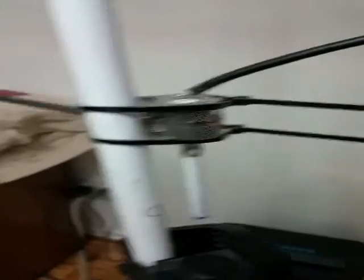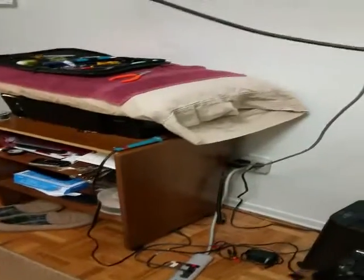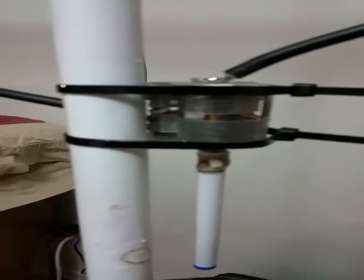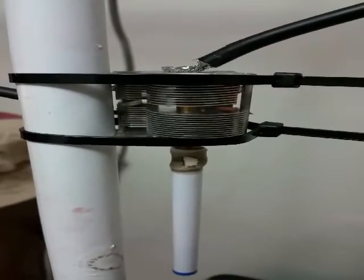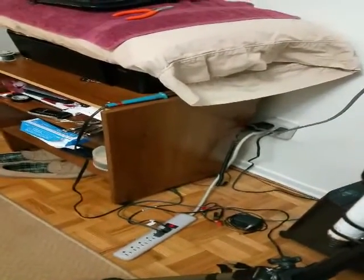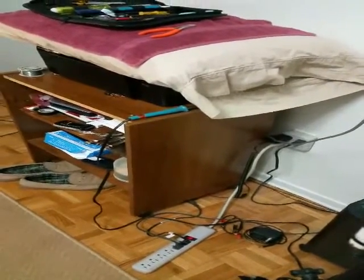The sweet spot on this is so small that you can't really hear it with your ear. You can, however, see it with the SWR meter. The main problem with this is the plates are really close together, so if I go above 10 watts it arcs over. I'll be back in a minute with the actual live test.